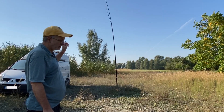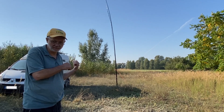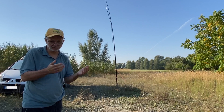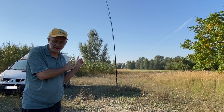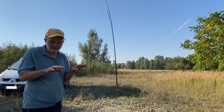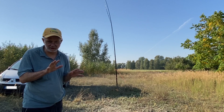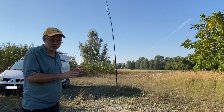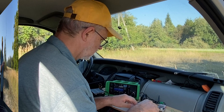This antenna, in this case, is a very good antenna to make tests on the equipment of today — the Micro PA50 and CGJ100 antenna tuner — because on some bands the ZS6BKW antenna needs no tuner at all. You just plug in and it works on five bands. On some bands it does take a tuner, so with this one antenna I can check both situations.